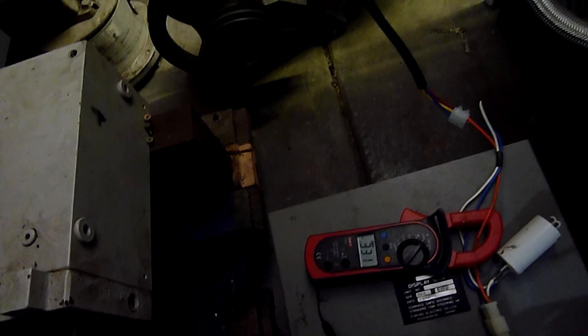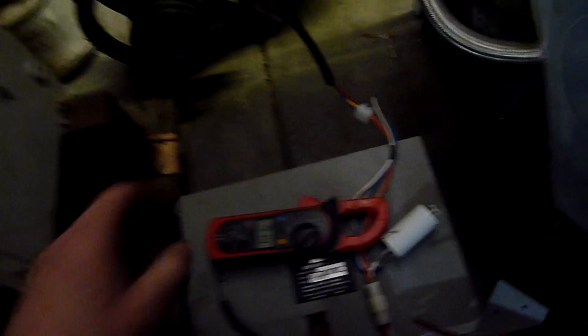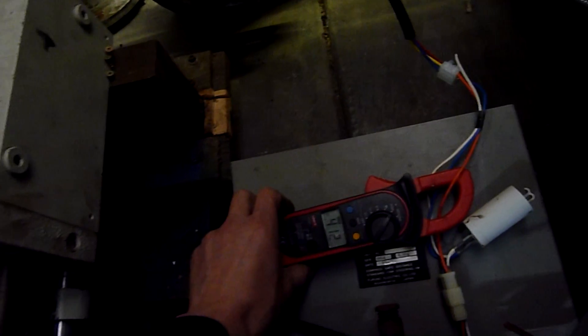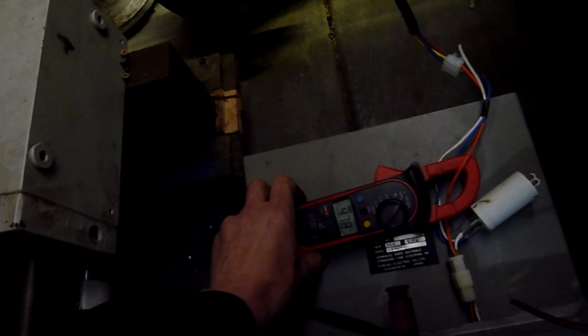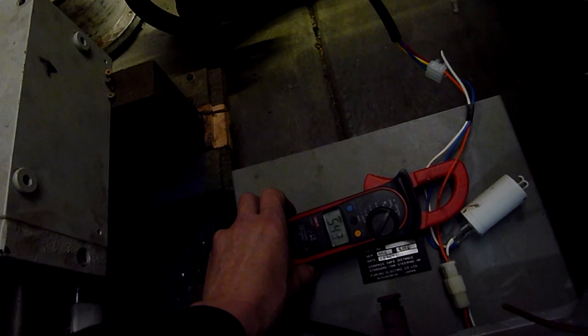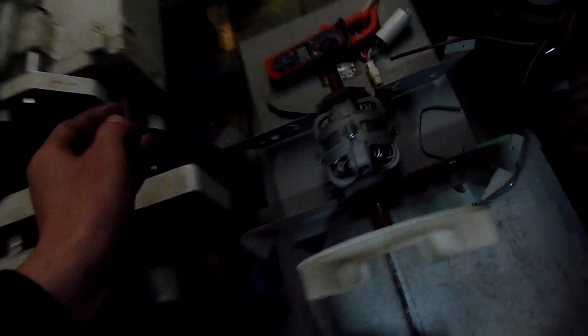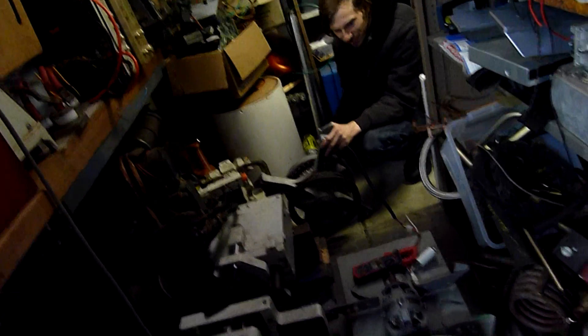Never mind the AC power used to charge the battery. How much current is it pulling? 0.332 amps — almost half an amp. 0.47 amps. You just passed half an amp and the motor's starting to stall because the frequency is getting too high. You end up with rotor slip if we go too fast. Don't let go of that trigger.